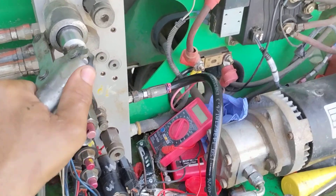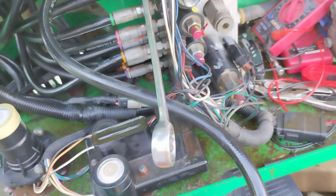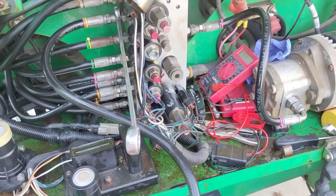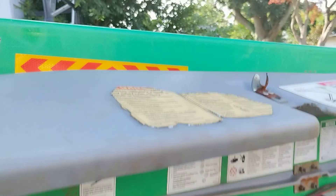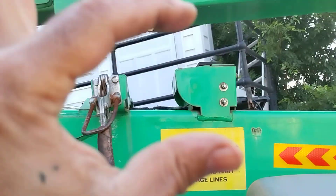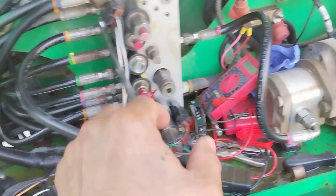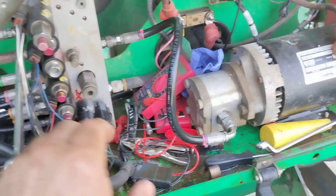This became springy — it's never done this before. It's springy now, like a spring in there now. It's never did that before. Like I said, all of these guys work. You don't have to over-crank this thing — these are the manual override. So you press the yellow, and one of these guys and you'll get action. All you did was turn the power on, hit your yellow, hold the yellow, and hit the button down here. And you can hit that one to return. You can bypass this pump action using the manual and using the pump to help you out manually.